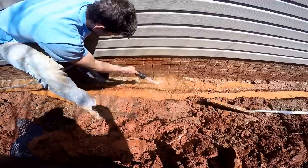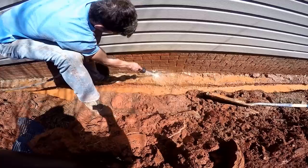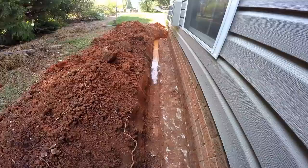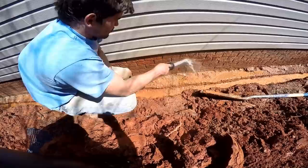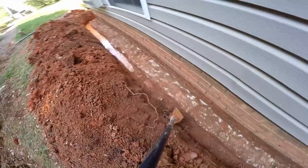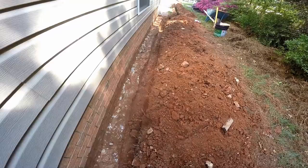Take your hose with good pressure and you can really clean off that wall. The big thing you want to clean off is that seam — get as much dirt and mud away from that seam as possible, because that's where the liquid rubber is going to set and seal up the foundation. You can see that water has turned the corner of the garage and is just flowing right along — it basically follows your footer. Remember, there'll be gravel down here and it'll fill up the pipe and go all the way out to the street.